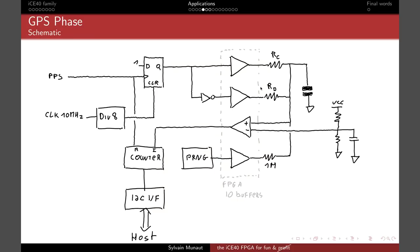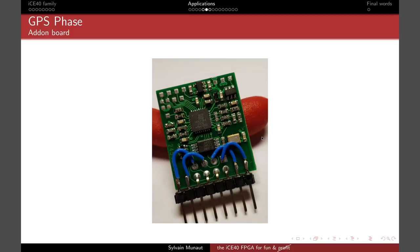to detect when the capacitor is fully discharged. This is a very low voltage, like 0.1 volt or something. And I'm using a differential input of the FPGA as a comparator, which is not really designed to do that. And because the voltage slopes down really slowly, the threshold isn't perfect, and so you get some noise. But in practice, it works fine. It doesn't matter.